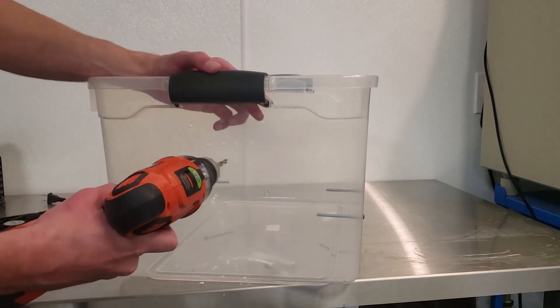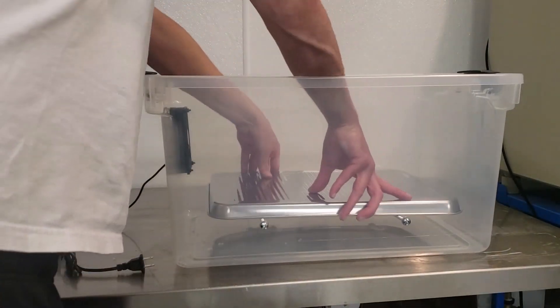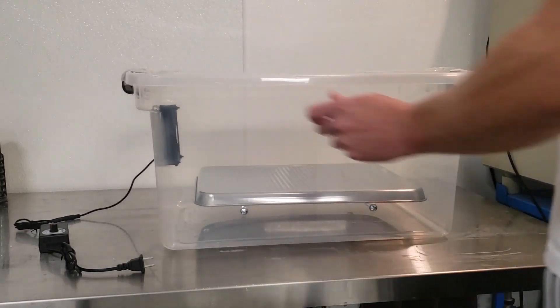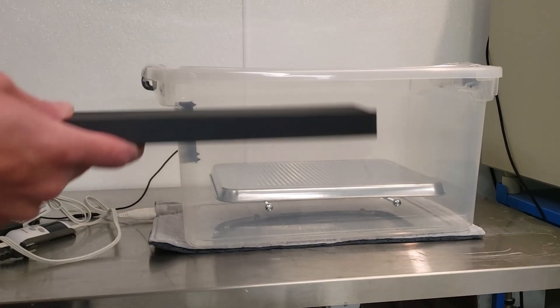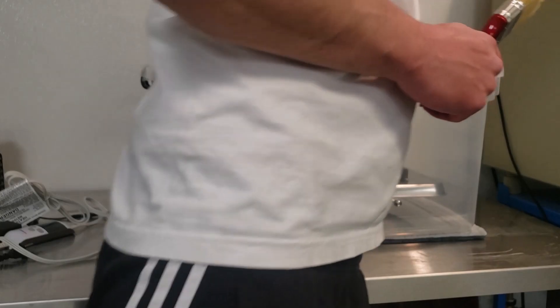The last step isn't really complicated. I always have my heat pad that I can place underneath, and when I have a pool of acetone or solvent at the bottom, I can accelerate the process by turning on that heat pad to get the vapor developed a lot quicker. That's all it took to create this very cheap do-it-yourself vapor smoothing station. Hope you enjoyed it — look out in the future for some of the parts I actually plan to vapor smooth.